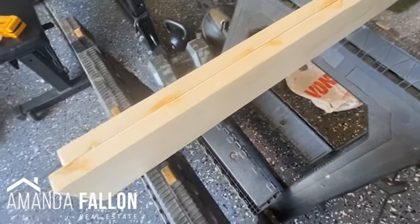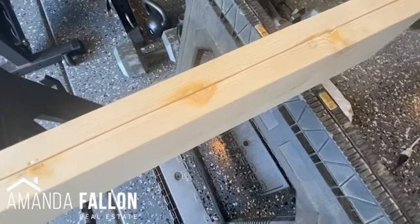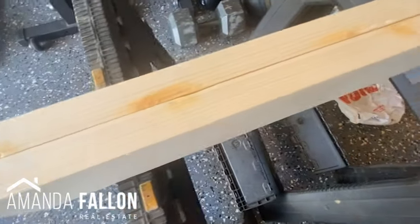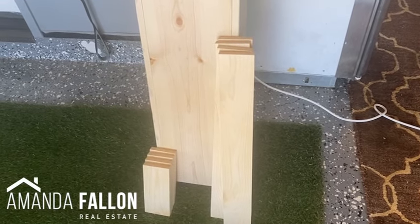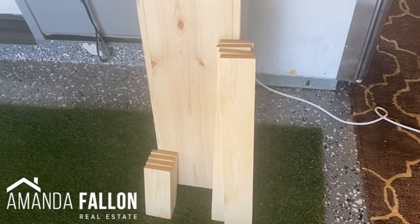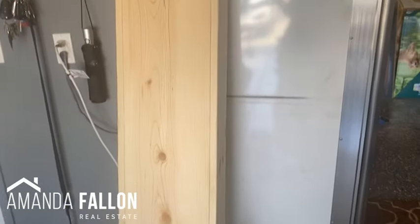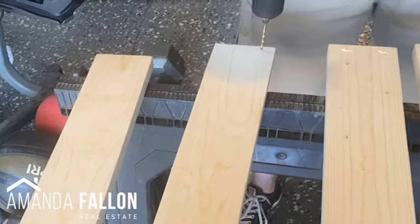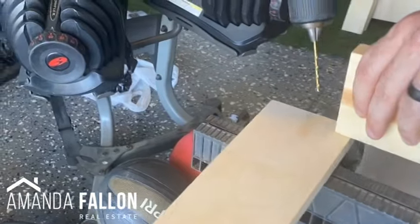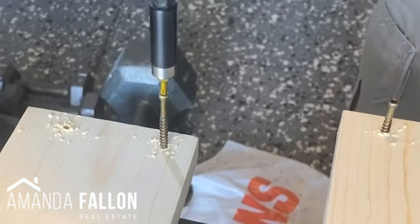The legs are all sanded. Some of these pieces had a few dings in the wood — since the plan is to paint these legs black, I really want it to look as smooth as possible, so I did a little bit of wood filler in there. We have the vertical and horizontal pieces for the legs cut, sanded, and wood filled. Now I'm going to attach them together, paint them, and then install them to the top of the table. We are pre-drilling the legs to make it easier on ourselves, using a piece of scrap wood to make sure the screw holes are going to be in the right spot.